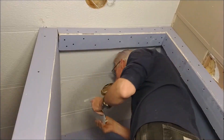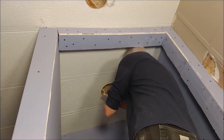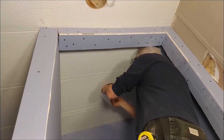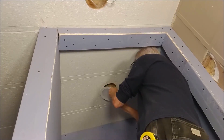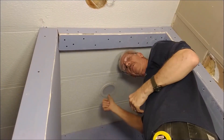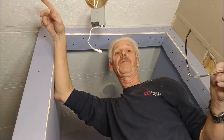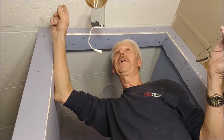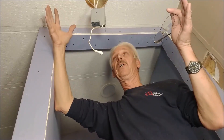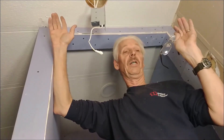Okay, now we're going to install this light. Watch how easy this is. I like to install the spring that's close to the wire first — just pull it up and hook it in. Then the other spring you've got to bend up high, stick it up in there, and voilà. That light is in, but it's not yet connected to the existing light. When you're working on a light, you turn the switch off and the light goes out and you think there's no power — but sometimes there's power up there even with the switch off, maybe to another wire hooked into the system. So be extra careful and throw the breaker. Don't take any chances. Do whatever you need to do to be safe.